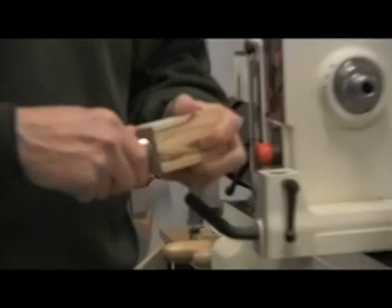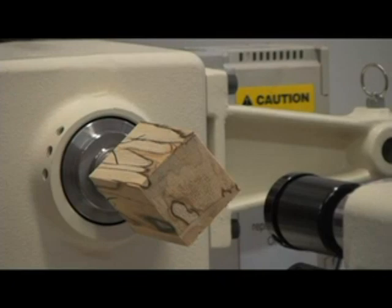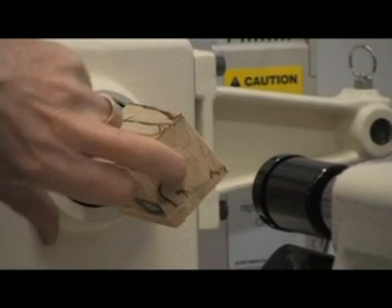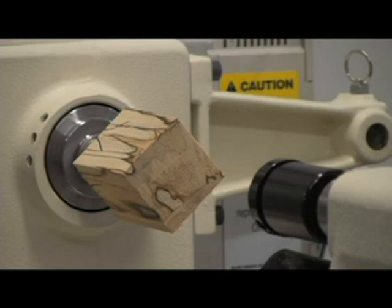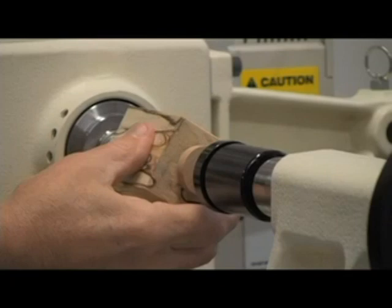The first thing you do is insert this into the hole all the way down to the end, then put it in the lathe. I'll bring the tail stock up to support the bottom while I turn the sides. You can bring your tail stock right up, but that'll put a little hole in the center. To prevent that, this little piece of scrap wood has a hole that fits on the nose of the live center — that'll give you the support you need without putting a hole in the end.